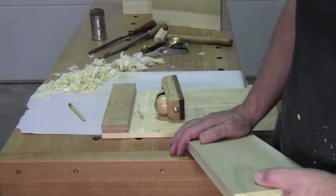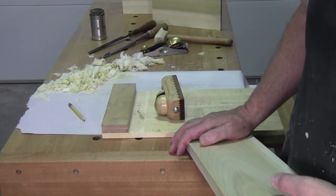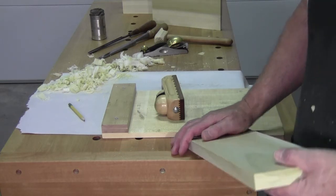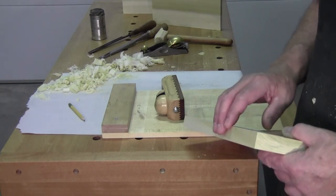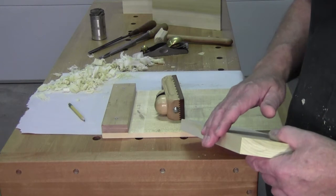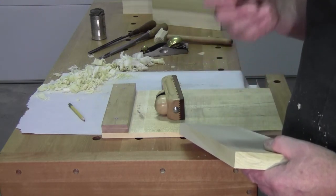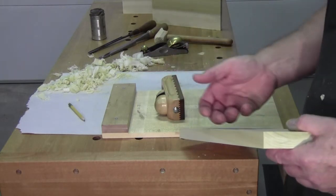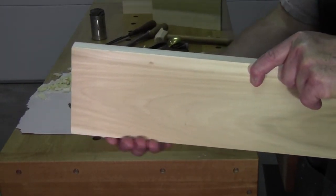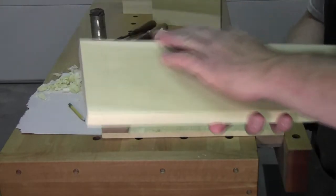Now, there are sometimes, and I haven't personally done a lot of this, but like on hand-hewn furniture, where you're using a draw knife and a spokeshave to smooth out a leg, sometimes leaving that little faceted round as opposed to sanding it perfectly round, that light faceted round, if it's smooth and splinter free, offers tactile feel. It offers a sensation. Sometimes on the underneath of chair aprons, if you leave some sort of smooth but unique tooling characteristic, it offers a sensation. So that would be the minimum right there.